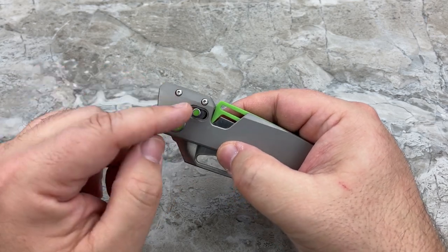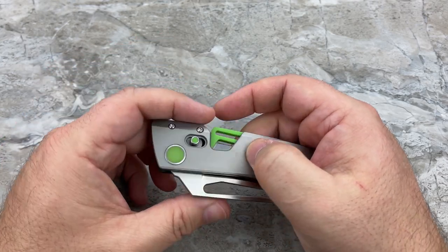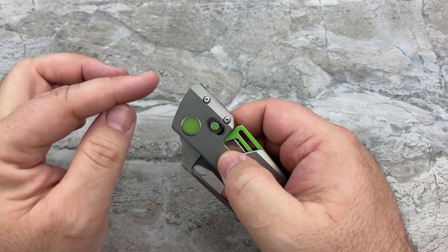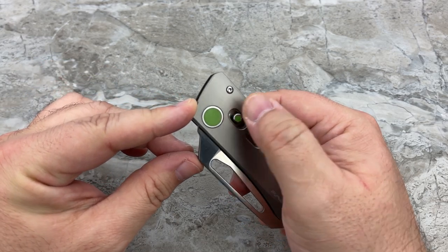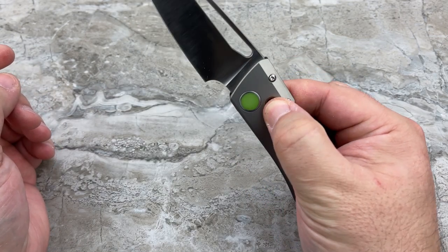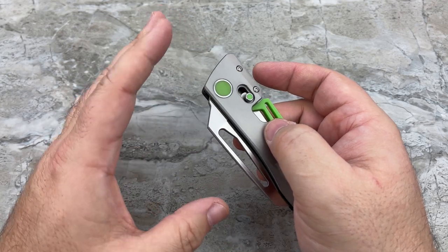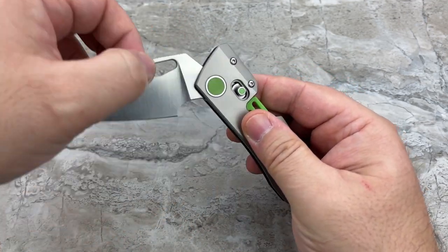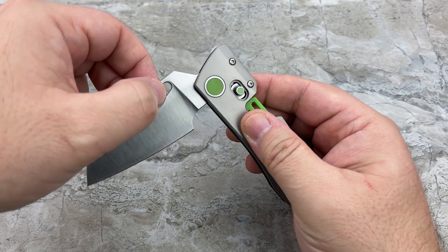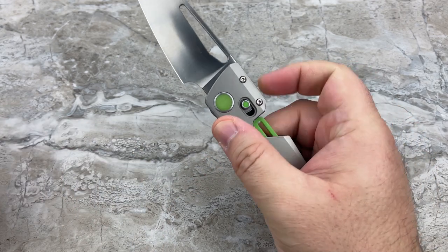That hockey puck engages in a slot in the backside of the blade so that it's completely locked — it's almost as strong as a fixed blade. The lock itself is not magnetic, but the part that holds it in place is. And as soon as you let go, there's no friction on the blade because there's no detent ball. It just rides completely free on the bearings, and when it gets close enough, the magnets inside suck it in. It's kind of nuts.